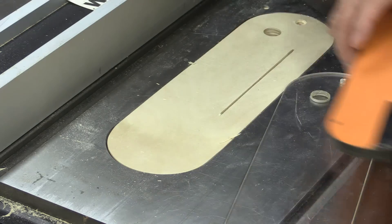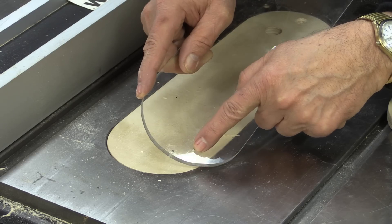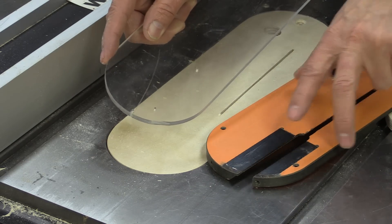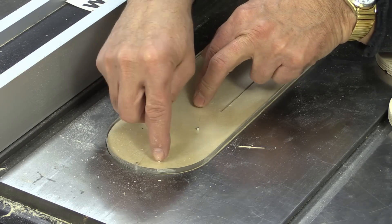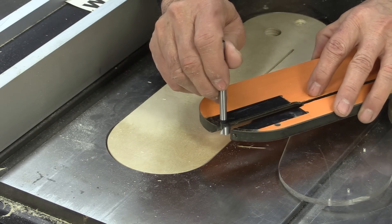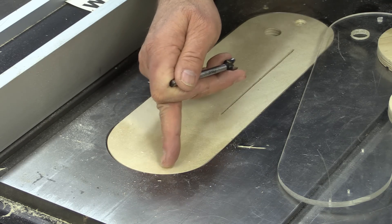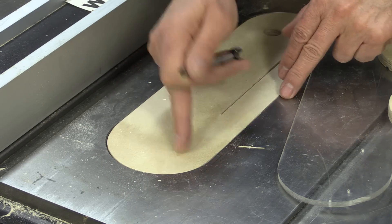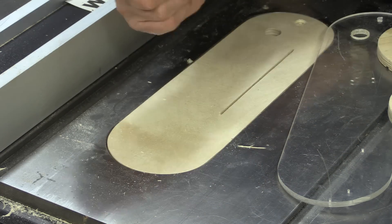The way I do that is with my plastic template. If you notice, I've got a hole there and another hole up here, and they coincide with marks I've made from my original throat plate. All I do is set that over top of my blade guard and just put a mark there and a mark there. Then I can use my Forstner bit — because my Forstner bit is the perfect size for that — so I drill a hole there and another hole there. Then I can cut that out with my bandsaw or with a jigsaw, and that creates a slot that I can put my blade guard holder into.